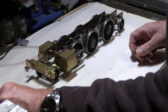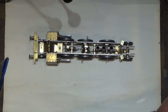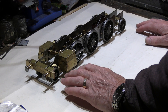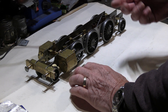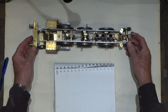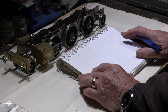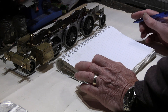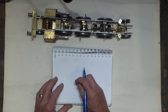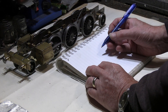I think I've mentioned the lubrication once or twice in the past. Steam engines have to have lubrication with steam oil - if you don't have steam oil in they're stiff inside and don't run particularly well, and it makes a big difference with a little bit of steam oil lubrication. Now there are a couple of ways this can be done on engines this size - there's a displacement lubricator and a force-fed type of lubricator.